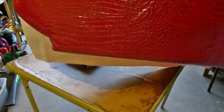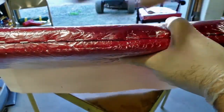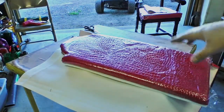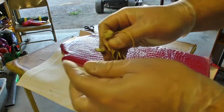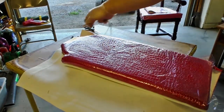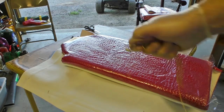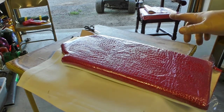We've got one side done and now we're doing the back — I have that foamed in. We're going to run the seam down the side so it's concealed by the edges of the chair. Just fold the fabric over and run the staples down the side so it's wrapped up real nice — everything should be concealed by the wood on the chair. Now this chair originally came with gumdrop buttons. To do those, you'd glue fabric over it, mark your holes on the back of the foam, punch holes through, draw your buttons through, and staple or tie them off. Because this is a vinyl material, I'm afraid putting holes in it will cause it to rip over time, so I'm just going to do one solid piece. If you're doing fabric, you should be fine.